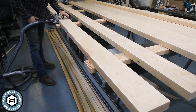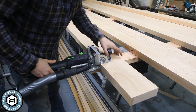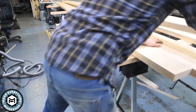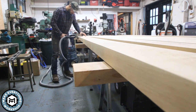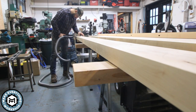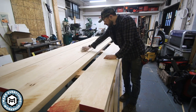Thank you so much, Jimmy — could not have done it without this and the TS-55 from Jeremy. With the domino joiner you're able to do a really nice oblong dowel that gives a really strong and well-registered connection between your boards. I used 10mm by 50mm dominoes and felt they added to the stability and ease of assembly. Those dominoes are pretty tight and make it so that when you go to line things up for glue, you don't have to worry so much about the boards being uneven.